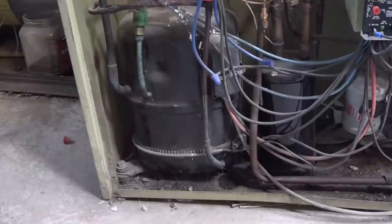What's wrong with having refrigerant drawn into the compressor? This is during the off cycle, not when it's running, because it warms up when running. Once refrigerant is brought into the compressor on the low side — the can side — it mixes with the oil. When it mixes with the oil it dilutes it. It's kind of like pouring solvent into motor oil — it thins it out and it loses a lot of its ability to lubricate.